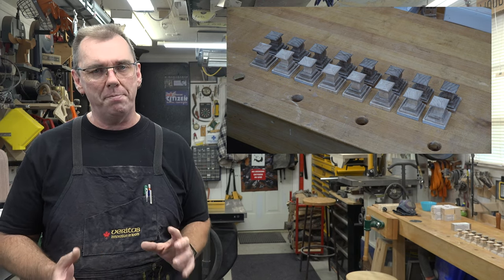Well, you have the one set of interior cuts done. And I just want to point something out to you or bring it to your attention before I carry on with the cutting. When you flip it now, because you want to do these interior cuts as well before you cut the perimeter, something you want to keep in mind. And that is that your blade is going to be going along at its regular speed, and it has the potential to suddenly speed up and go forward. And if you're on a curve here, that could really cause you to lose control. So be very careful of how much pressure you're putting into your blade.